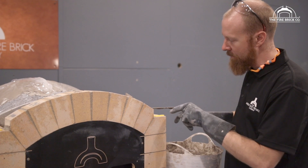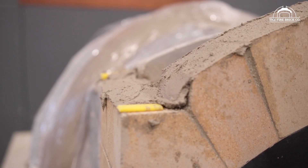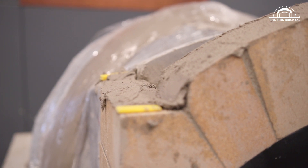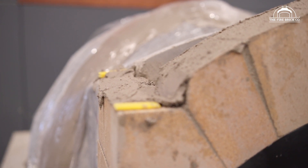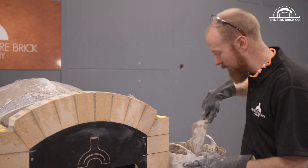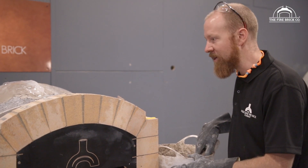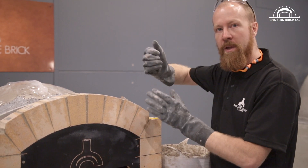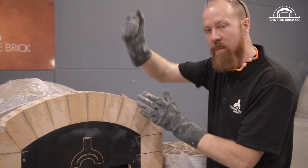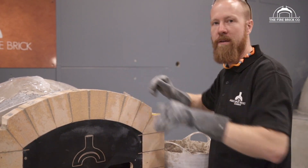On the sides, I'm going to put in just a little bit more than the amount allowed for by the spacer, and it'll squeeze that out — but I don't want to put on lots and lots more. I've done it the other way where I put on way too much and you end up really having to thump the flue gallery, bashing it with your hand to try and get it to sit down and push that mortar out.